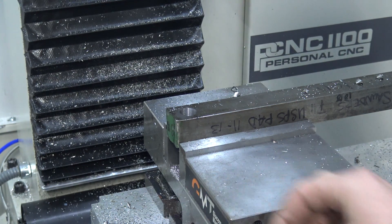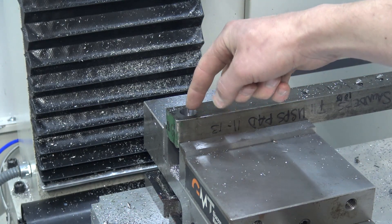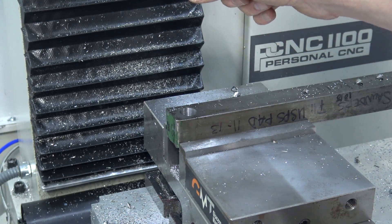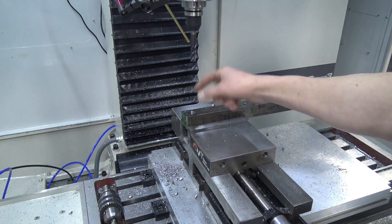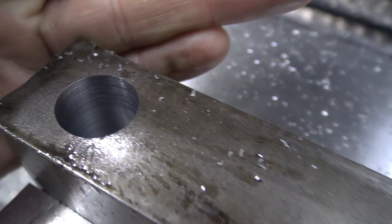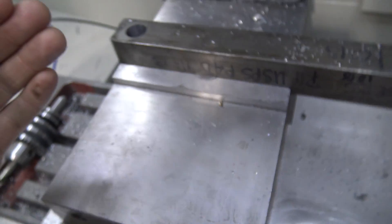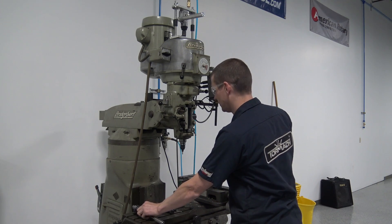The beginning of that sounded pretty horrendous, but that's because when it's plunging into a half-inch hole there's so much engagement — something like 270 degrees of the tool is engaged on that first pass. One solution would be to drill this out first; even drilling to five-eighths would help a lot. But once it was out further, it wasn't the worst thing. The surface finish is honestly not as bad as I thought — actually not bad at all. Certainly textured and rough, but not bad.